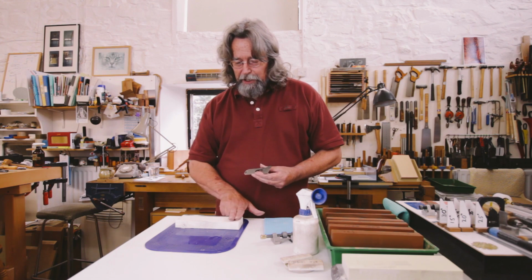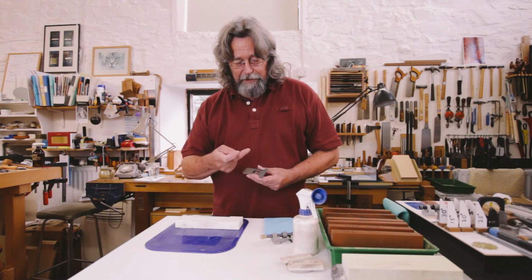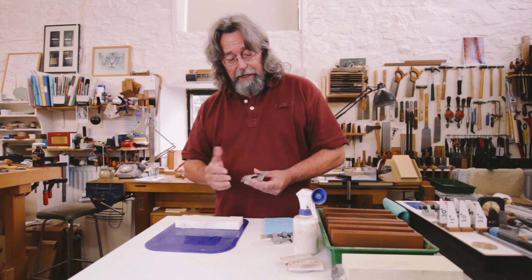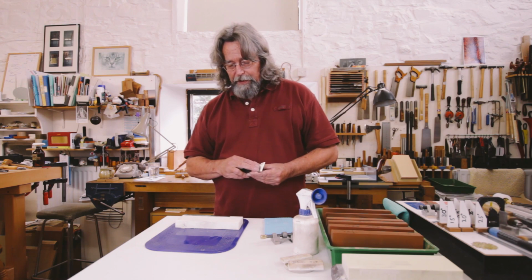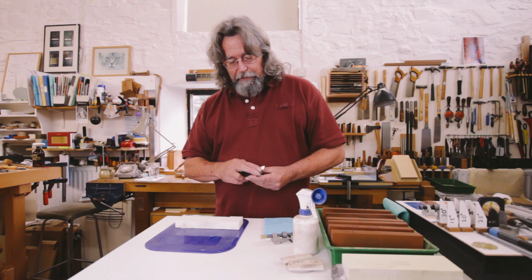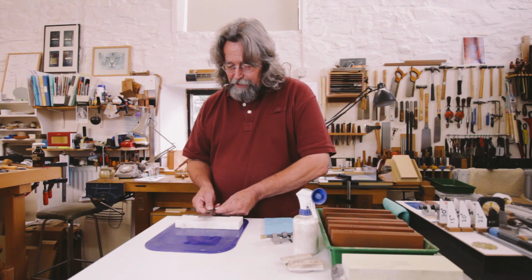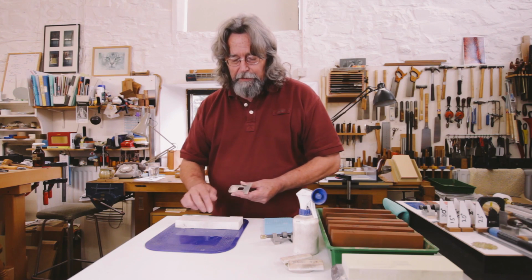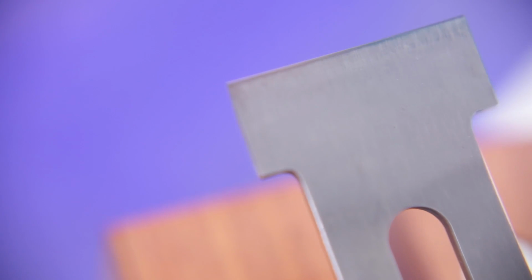If we think of a traditional sharpening, it requires the stone to be perfectly flat and the back of the tool to be perfectly flat for the wire edge to be honed away. And it's quite clear from the number of people who enjoy stropping as a final stage that this doesn't really happen very often. The probability of honing away the wire edge is massively increased by tipping this up at a little 2/3 of a degree on the ruler, because the contact area is so much smaller, and I find that it's very rare for me to get a sharpening failure.